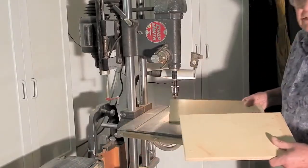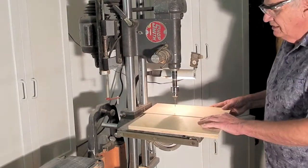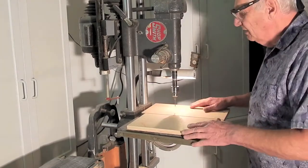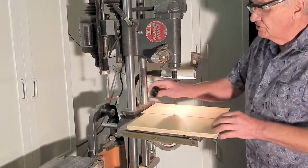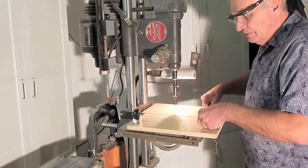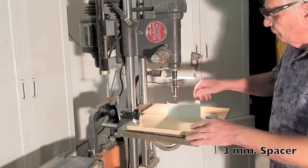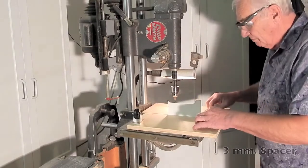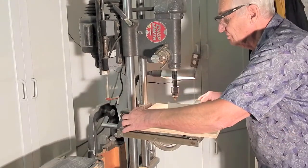These are the floating boards, underneath the base of the cabinet, that carry the retracting casters. We need to screw the casters and a pair of hinges to the underside of these boards. So I'm going to use a scrap piece of 1/8 inch plywood to space these 2 panels while I mark for the hinges, and then I'll mark for the casters.